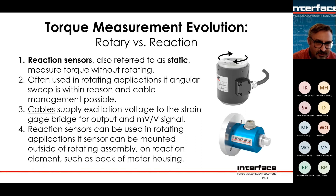This is commonly done in engine dynamometers, or for testing engines or motors where you have some kind of brake system. That brake may be spinning, but the stationary part can be mounted to a reaction torque sensor — or sometimes mounted on bearings using a reaction arm and load cells. Engine dynamometers using eddy current brakes or water brakes often use either reaction torque sensors or even load cells. Just because somebody says torque doesn't mean it has to be a torque sensor — it could be a load cell if the torque can be reacted at an arm.